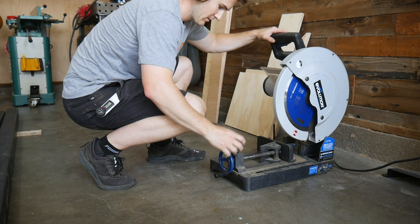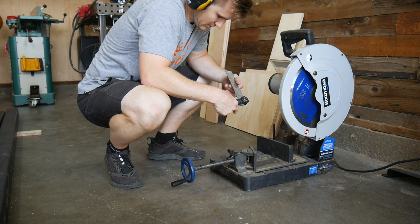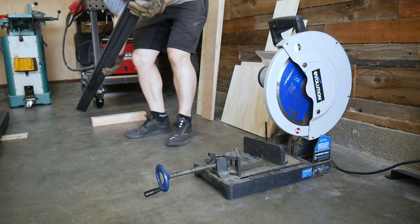The base is made entirely out of three-inch square steel. The legs themselves have a seven-and-a-half degree angle to them. We're going to break all of those components down using the metal chop saw — set the chop saw at seven and a half degrees using a protractor, cut all the pieces so they all have the exact same angle, and then move on to welding everything up.